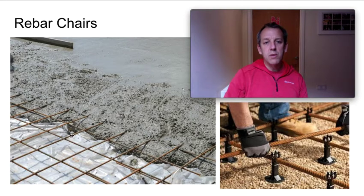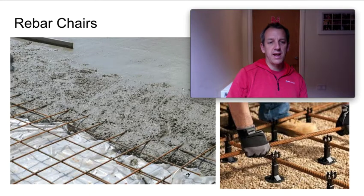You can see here a different form of rebar chair with concrete being poured around it. In this image we've also got a damp proof membrane — a waterproof layer. Remember that's different to a damp proof course. This is probably a suspended floor raft foundation being poured here.